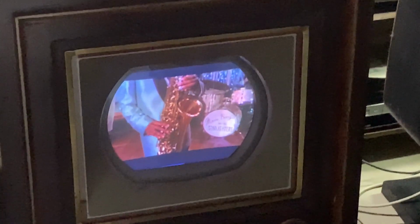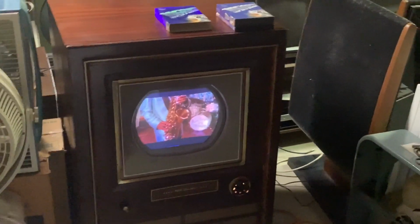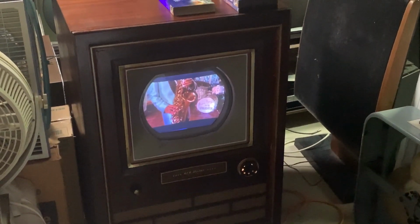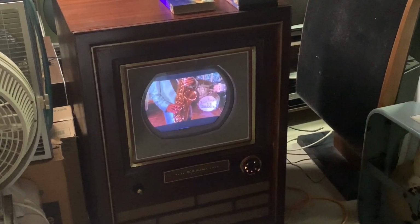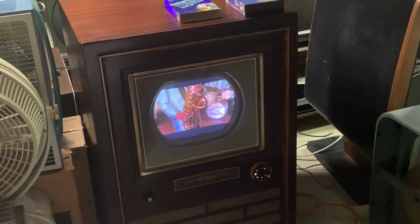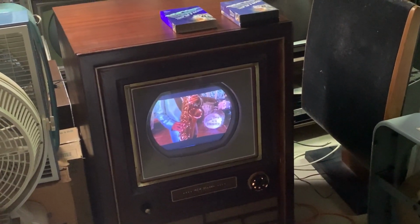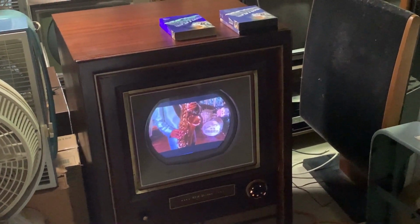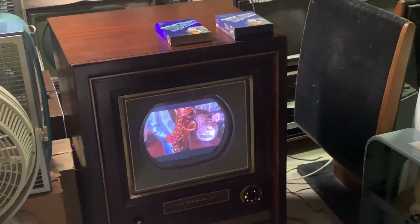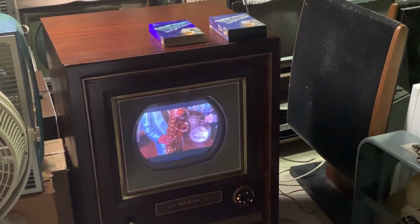One question might be how it compares to using it on the tuner. Since I fully did the IF alignment and everything, the picture's really close, pretty much the same, really. It's just that with cheap RF modulators for DVD players, you really gotta mess with the fine tune to get it just right on this particular set. So by using the AV input, especially for playing Macrovision stuff, it's not gonna affect the audio. In video, I can just adjust the vertical hold to get those Macrovision lines out of the picture. It seems to work just fine, and I'm very impressed. It's a very, very clean image now.